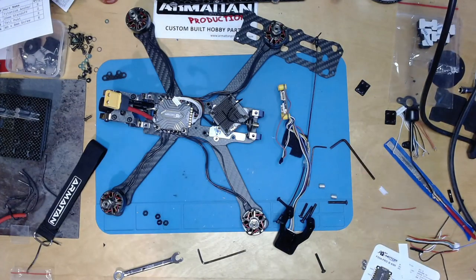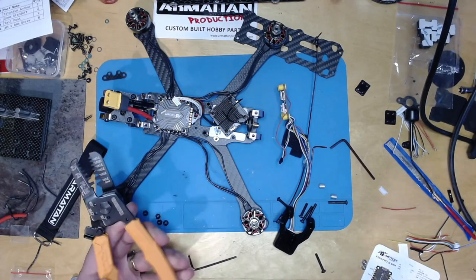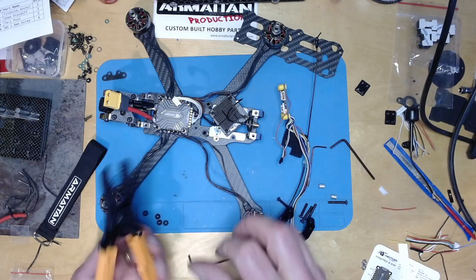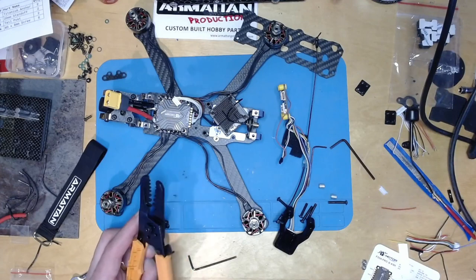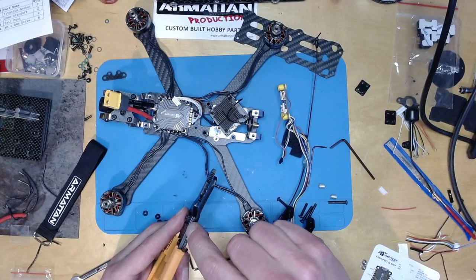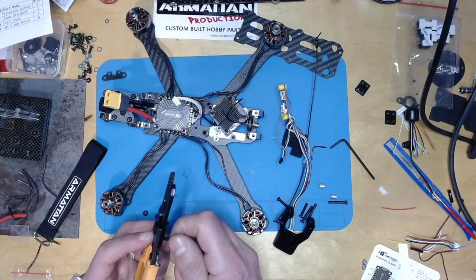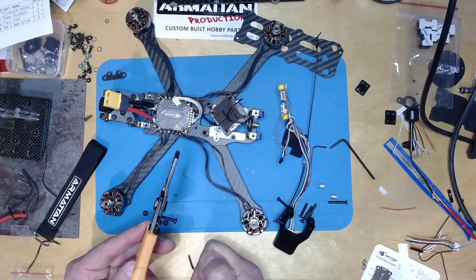Right, so that's my little Christmas miracle. This tool worked amazingly well. So I had some 25mm bolts, and the way this works is you screw it in through there, and then you cut it. Fortunately, I think the ones I had weren't hardened steel. They might have been harder if they're hardened steel. But the nice thing is the gap here is 3mm, the thickness of this metal. So all I had to do was take my 25mm, screw them all the way through till it just protruded the other side, just like that. So then I had 22mm left, cut the end off.